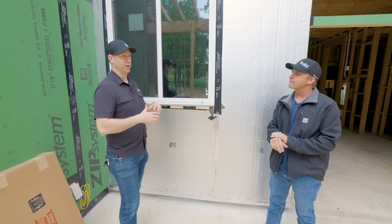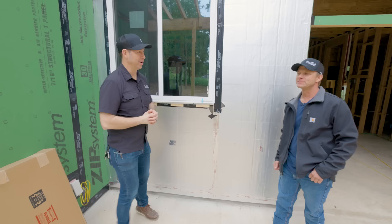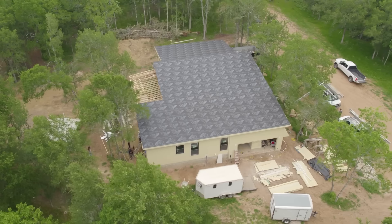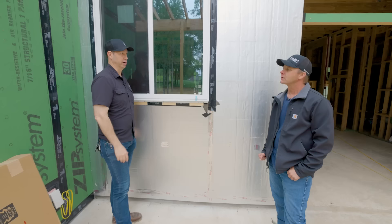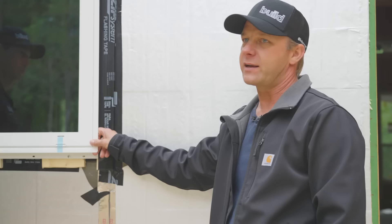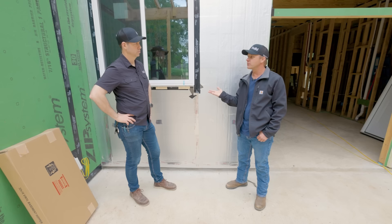On the other hand, if we're in Maine or we have bigger or more windows, it certainly can make a difference. Right here you've got a big porch — when your metal roof porch gets on, it almost doesn't matter what your SHGC is because they're in the shade all the time. The same goes for the rest of the house — you've got overhangs and trees. So really the only downside of a more basic window is U-factor. And to go up to triple glaze is a pretty big price point jump. So if you have a fairly simple house with not a lot of windows, bumping up to the next level of window is really almost a cosmetic decision — you will get a much nicer-looking window, that's for sure. Now, if you've got a wall of windows, it's not just cosmetic anymore — you have to worry about the performance.